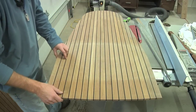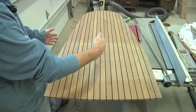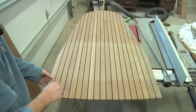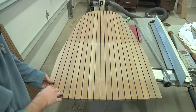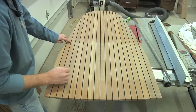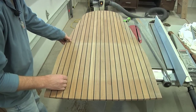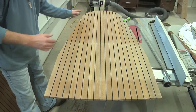I've traced roughly where the border is going to be in pencil. Because we're on a little bit of a taper coming in, there are going to be some terminations for each of these planks that are tapering in on the sides. What I like to do — and it's something that Teak Decking Systems does as well — is where these strips come in, I like to recess them into the border a little bit and give a little rounded end, what I call a nib. The way it's looking, I'm going to have four nibs on each side.